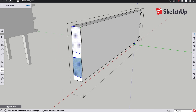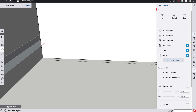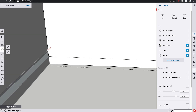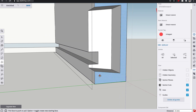This would be much easier if we had access to the solid subtract tools like on the pro version. We'll just copy those, come around to the other side, and trace around the remaining ones. Then the same on here — copy those, push them in independently. Now spectacles, unhide all. We've just got to get a groove in the back of the front — let's connect that with the bottom of the groove on the sides. You can see this is why the groove needs to be contained within the tails: if it were lower, the groove would start cutting into the end grain around here.